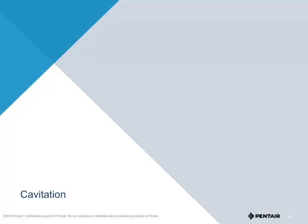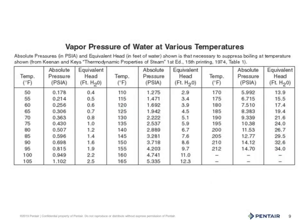So one surefire way to destroy or damage an impeller is cavitation. But what is cavitation? Cavitation, simply put, is boiling water at the temperature the water enters the pump at. Literally, we're flashing from a water liquid state to a vapor and back to a liquid state. Moreover, this is water vapor and not air. If it were air, it would not have the energy to do the damage that this vapor bubble collapsing does